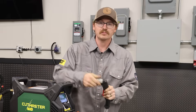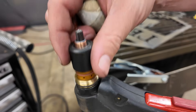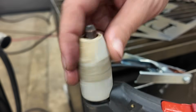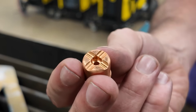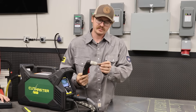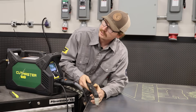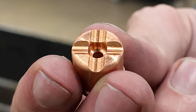If we're running 70 amps, make sure we have 70-amp consumables. If you don't have the right consumables, the machine is not designed to run with that tip, so make sure your consumables match what you're reading on the machine. There's also a drag tip, which I like when cutting straight lines — you set your torch at height and simply drag. For artistic work, I like to run without the drag tip because I can set my distance and actually see my arc. Those drag shields have prongs that can block your view, so we're going without it today.